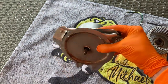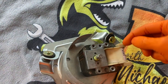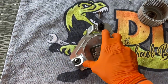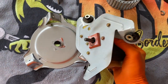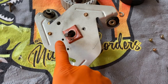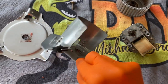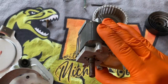Next, turn this over and remove the three quarter-inch screws that secure the outer plate to the inner plate, which houses the rubber grommet gaskets. With those three screws removed, carefully shift the plates apart. On the back side you've got additional quarter-inch screws — remove the three closest to the actual center rod. With those three screws removed and organized in the same pattern, carefully pull this plate up and off. This is your old inducer motor — now it's junk.